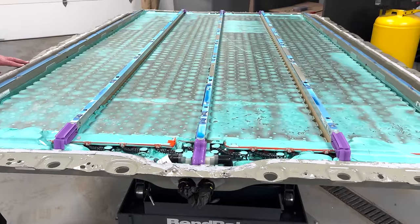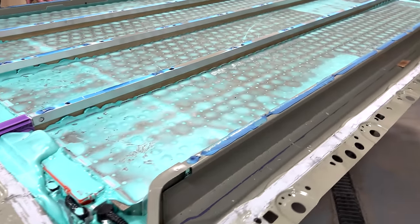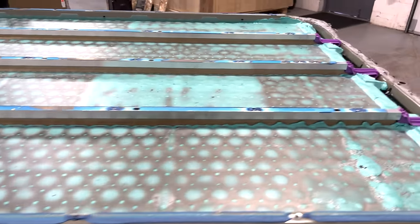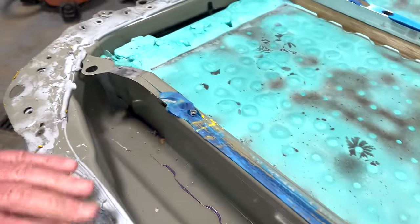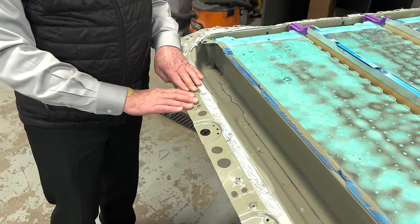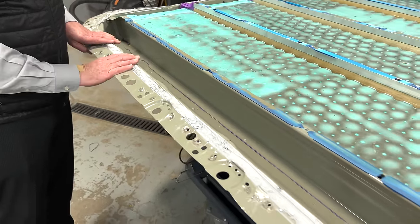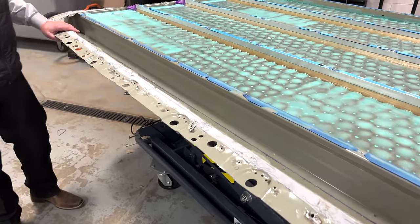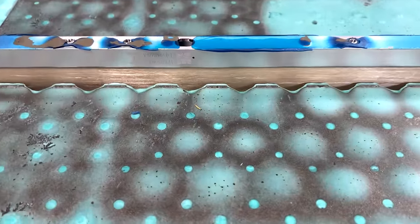This right here is our RTV, and that's kind of what we use for sealing and gluing things. This looks like an anaerobic, which means when I put it on it'll stay wet forever until I put something over the top of it, screw it down, and then because there's no air, that's when it'll cure. This cures in atmosphere, so you put that on around the intersections on the top surface, then you put the RTV on. This is a crash zone - out here I'm bolted to the longitudinal nose. Some people call them the rockers.